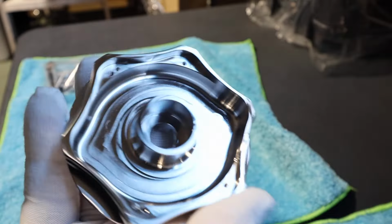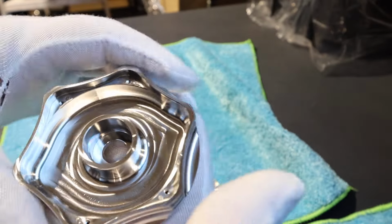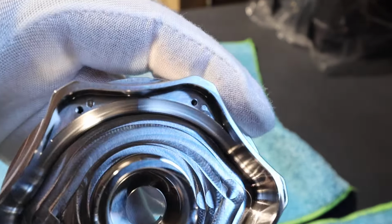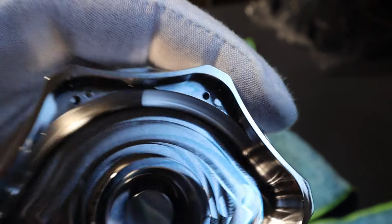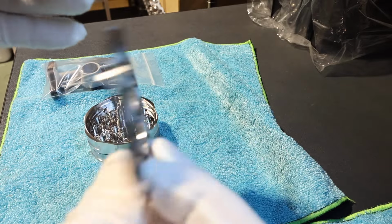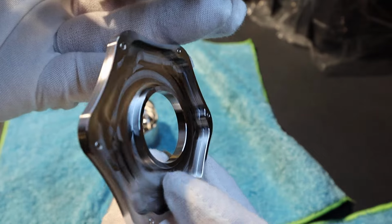And that's the inside. So there's 4 magnets in the corners. I've also put threads in the corners. I don't know if you can see the threads. So there's a magnet there, and then there's a M2.5 thread next to it. The idea is I'm going to release this file. I didn't show you the back of that, it's pocketed out.